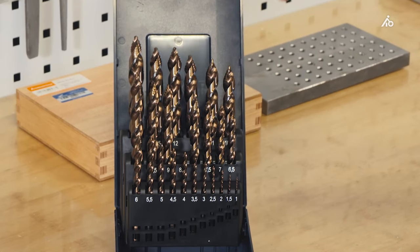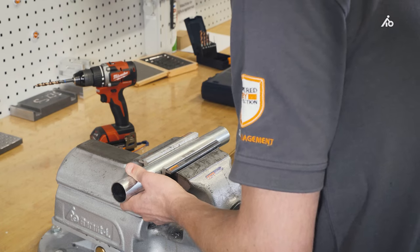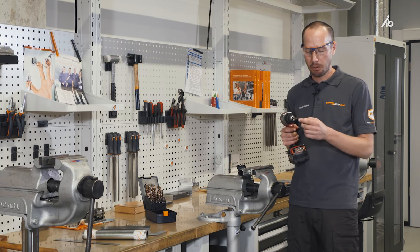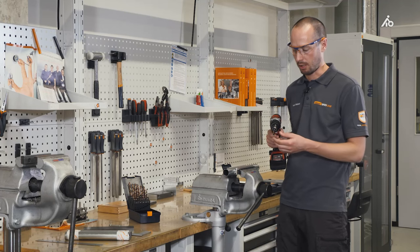Here I have an assortment. I like this one because it works very well, even to clamp in the vise. The first mark is all the way up. I have already clamped the drill. I don't need to punch — the drill has such good centering characteristics that I can drill directly onto the bright surface.